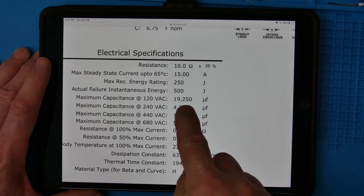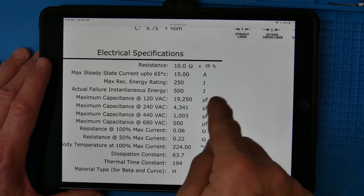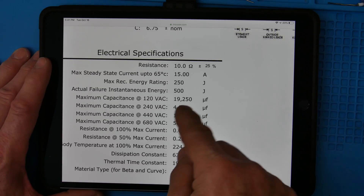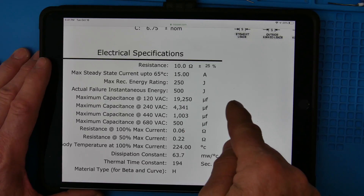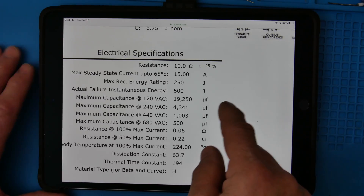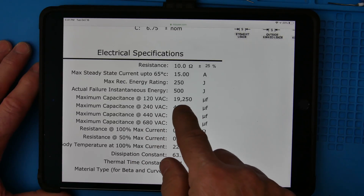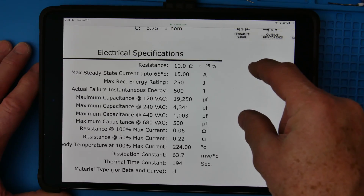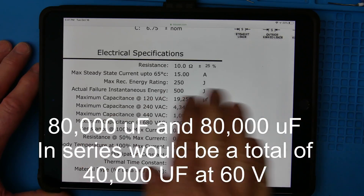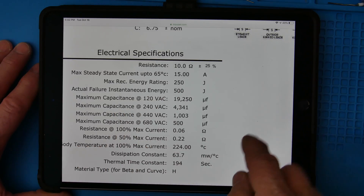With this part you go up to 20,000 microfarads. And when I mentioned going on the other side of the transformer — if you're at 60 volts on the other side, but really on the other side you're plus or minus 30 volts, you're really about a fourth. So what that means is you could go four times this value for each voltage rail. If you're at 30 volts, you could go up to about 40,000 microfarads per rail before you have to worry about this thing failing. The rating where it fails is twice that high.